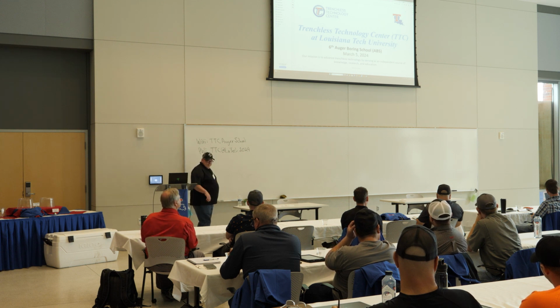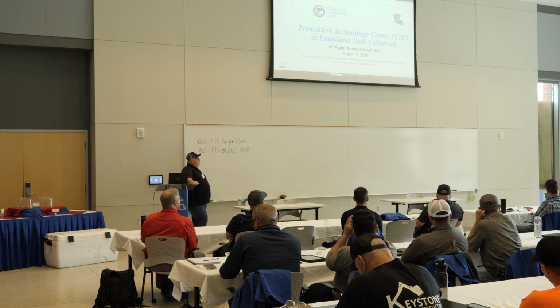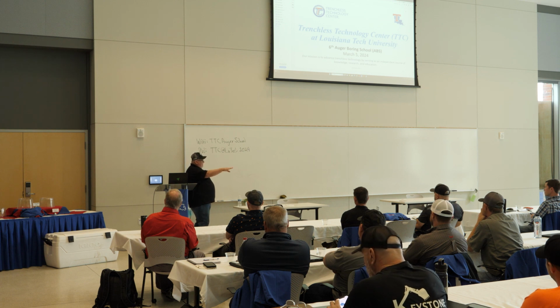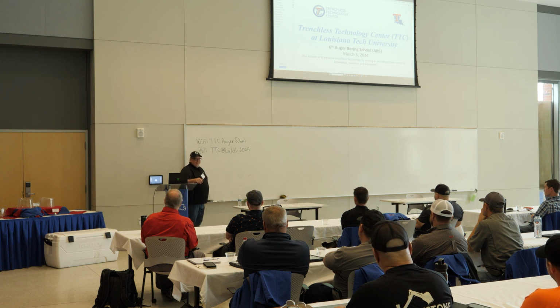Because if you get off, you're going to create all kinds of problems, and that's when people start fabbing stuff to make it work, grabbing a hold of the casing, pulling it over, and putting it in a bind to get it into the master pusher, all that stuff. I've met a lot of people too, with older stuff, that they know they got to hit a point here, they would take the machine and they know it's going to go to the right, maybe angle to the left, so it would steer and hit the point they want to hit. That's, don't do that. It's not necessary. When you start curving the bore, anyways, you start creating more thrust pressures and torques on the auger.